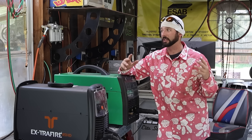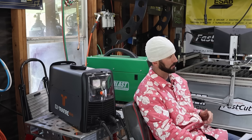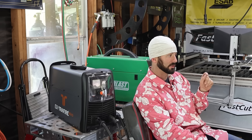The first thing we're going to cover is the air needed and the kind of air coming out of that torch — it better be dry. Before you pick a compressor to accompany your plasma cutter, you need to figure out what machine you're getting. The Everlast Hurricane needs a cutting air pressure range of about 65 to 72 PSI. It recommends around a 30-gallon compressor with 5.2 CFM output. You want at least one-and-a-half times that for the plasma cutter to run continuously without struggles.